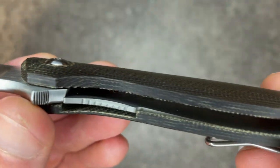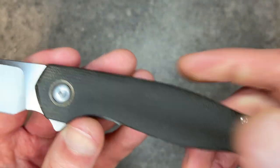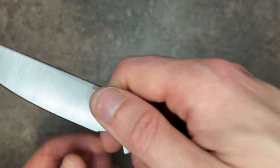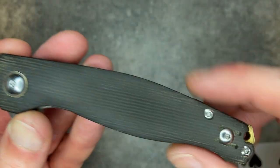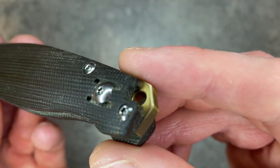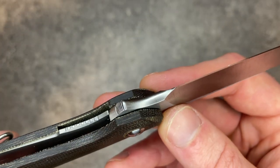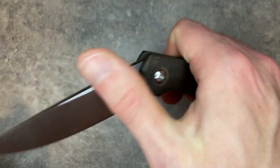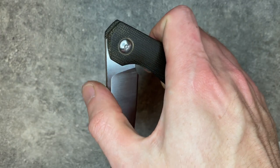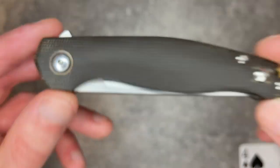The handles are very nicely fit and finished — solid micarta. Nice little bevel on the front helps with your pinch grip. The contouring is very well done and very even. The screws are all evenly proud, with the dome sitting consistently above the screw — that's deliberate. Backspacer is flush. Everything fits together nicely. Liner lock access is plenty fine. The way they cut this choil is very effective. No issues with lock stick. Solid action — the bearings are functioning perfectly. The detent ball is in a nice position so it drops very easily.